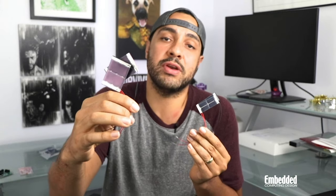This of course starts with the panels. There are two different panels here: the MPT 2.4-21 panels of the PowerFilm Classic application series and the LL200-2.4-37 indoor panels, both of which are based on amorphous silicon material — the same stuff that powers those calculators you used to use before you got a smartphone.